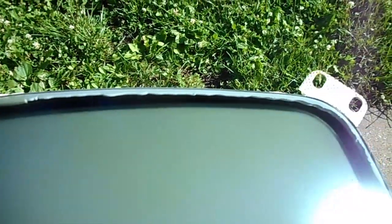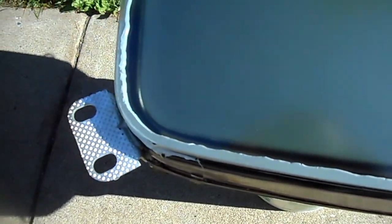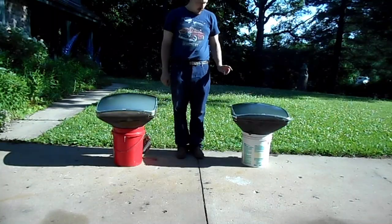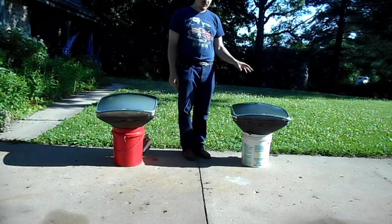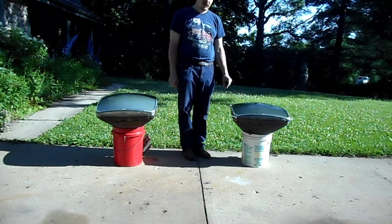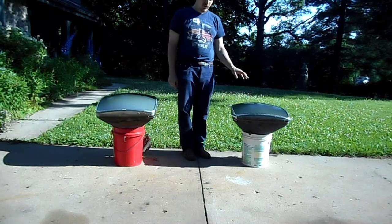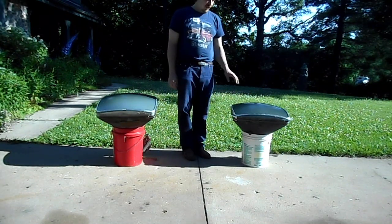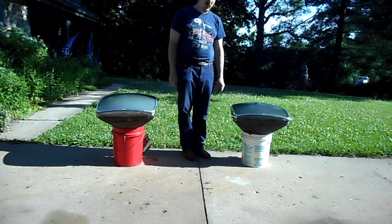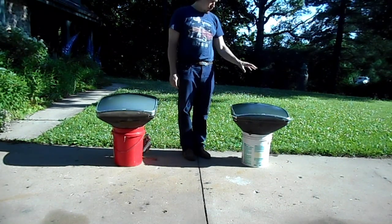And here's the RCA CRT. I think I got the caulk slightly smoother on this. I was fighting a tube that wanted to plug itself up every few seconds, but good enough. So the RCA CRT is very unusual. Most CRTs with RCA style cataracts, especially ones that are genuine RCA products, usually the glue is substantially too hard to even start to get the guitar string in. But this one cut with guitar string, which is very, very unusual for an RCA style CRT cataract, and even more unusual for a genuine RCA tube.